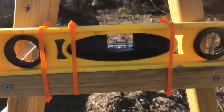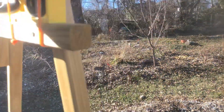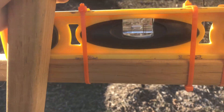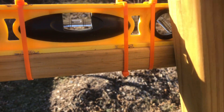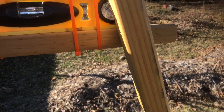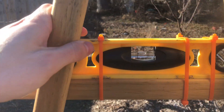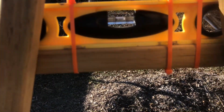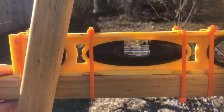I'm going to stick my feet down here as a guide, and I'm going to flip this all the way around. So I'm flipping it around and checking it in the exact same two points. This one is perfectly level, but in other cases, if the crossbeam is not set up correctly, you're going to see that it's level on one side, and then when you flip it around the other way, it's not level anymore. So you have to play with the crossbeam to make sure that it's level on both sides.